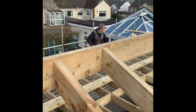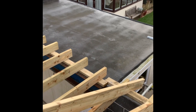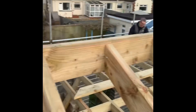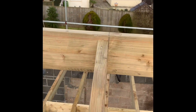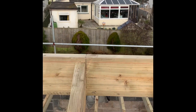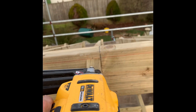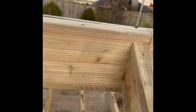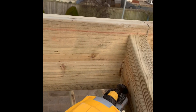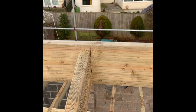What we're doing here: I always fix the bird's mouth first, go along and fix the bird's mouth first, then come up and do the plumb. We've allowed an inch for the batten here — that's really just to make it easy when putting it up. If you put one square through the top it really draws that plumb cut. Two nails in the side and two on the other side.